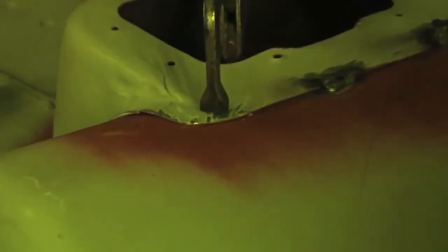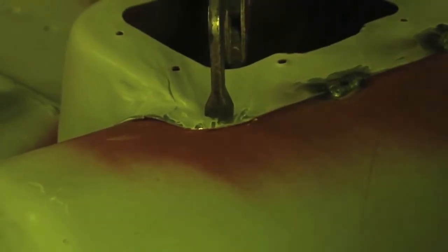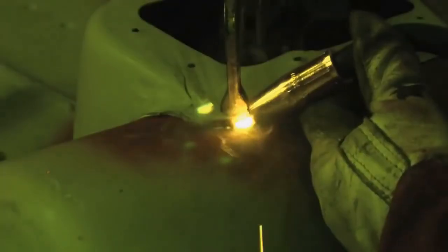It's going to be another great look through the helmet cam at the lap weld. What I want you to look at this time as I strike this arc is how much I'm pushing the wire in the one direction. This is the push weld. Now watch it push. Right here, you can, whoop, there it goes. One more time. That's about 5 beads down there and cool it down. It's a great lap weld.